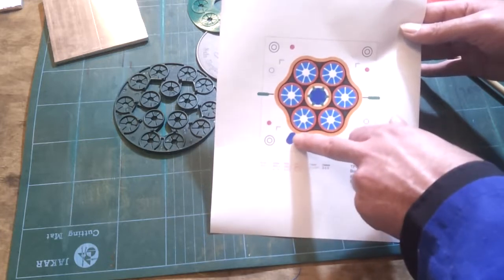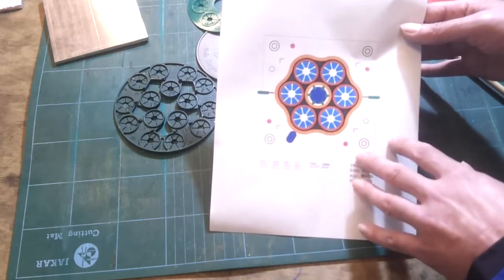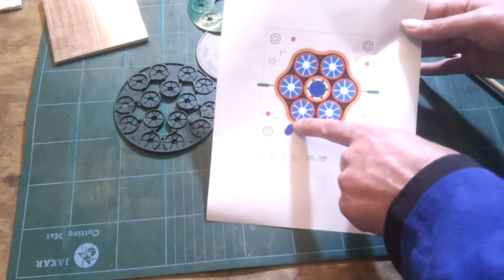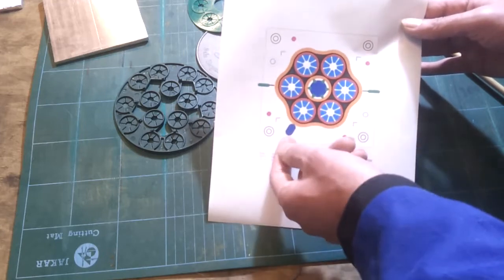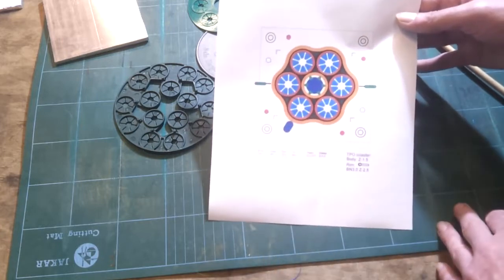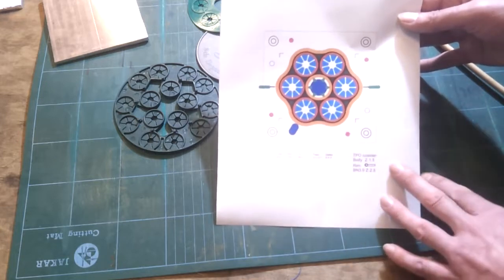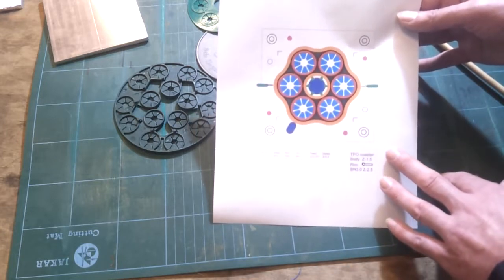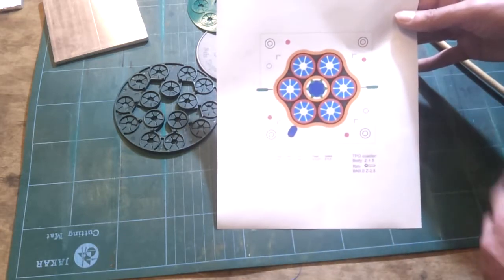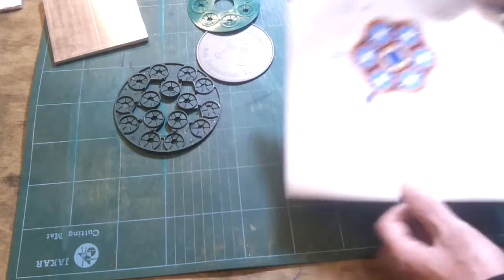I'm also going to add a little tag at the bottom because I'm going to do this single-sided, so all of the part is going to be stuck in the cavity and it may be a little tricky to get out. So I'm thinking if I put a little tag on the end, I've got something I can actually pick into and peel the thing out if necessary, and then I can just trim that off at the end. Would like to do a double-sided moulding, but I think I'll stick with a single-sided to begin with, and I can add the other plate if necessary. So I'm going to add a couple of guide pin holes just in case I do need to put a secondary plate on this, and that'll just be feeding in through the back.